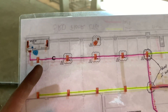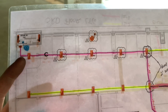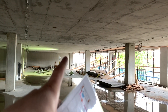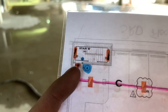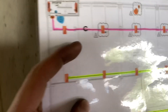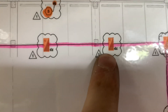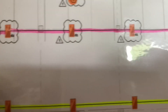This pink line is the emergency circuit, which also stands for the 12-3 wire. I ran basically all this throughout the day, starting here on this pink line. As you can see, there's a coil over there for the exit side, which is right there by the stairwell. The circle right here is the exit sign marker, and all these other squares are the lights — wherever there's a light, that's where I'm leaving a coil of wire for the drop ceiling.